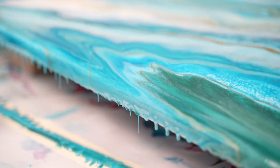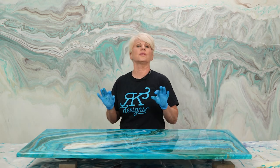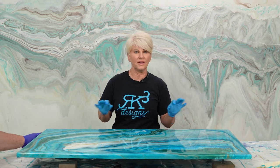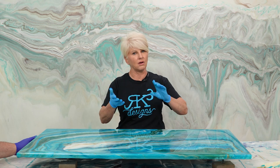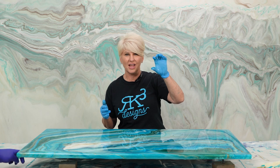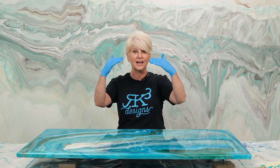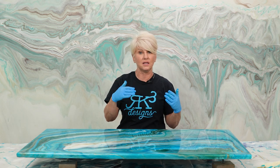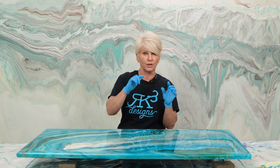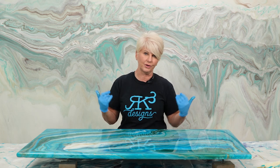When your drips are stringy like this initially, right as you peel that tape, home run, you've hit the timing perfectly. One thing to note, this is just a 3/4 inch piece of MDF. If you're doing this over your countertops, you're going to have probably 1.5 inches or so of reveal. So you're going to have a little bit more time and you may have to help that epoxy a little bit by running your finger, like Mitch said. It'll just help get a really pretty edge.